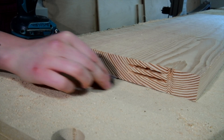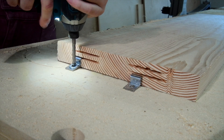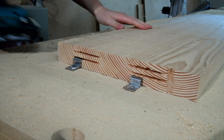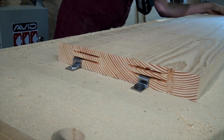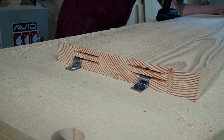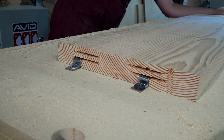I'll make sure that my material is relatively square to the machine and then use screws and Z brackets slotted into the biscuit slots to hold the material down. As you can see, the distance of the slot from the spoil board needs to correspond to your Z bracket height. I'd recommend doing some test cuts to dial this in.